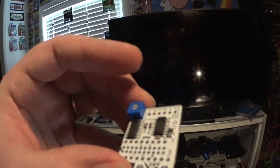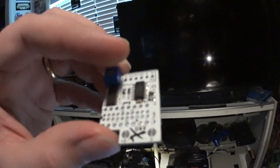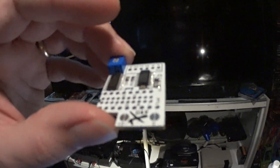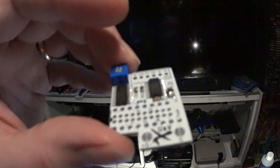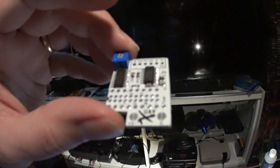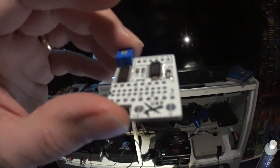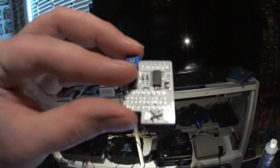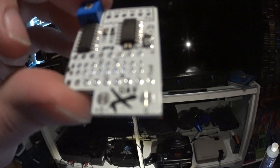It's really small so it can be kind of hard to solder onto, but similar to the Magic Knight board you only have to attach wires from this board to specific points on the 7800 main board - no permanent modifications or component removal required. Even on the Magic Knight S-video board it's still recommended that you cut or remove the RF circuit to prevent interference, but with the UAV you can leave the RF modulator intact because this board directly captures the video signals off of the video chips inside the Atari, puts them through a new series of buffers and encoders, and gives you separate outputs - completely isolated from everything else, so it's not subject to other interference. He's even got a cool little picture of a drone on the bottom of his board that says UAV.